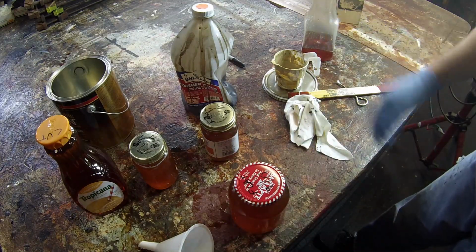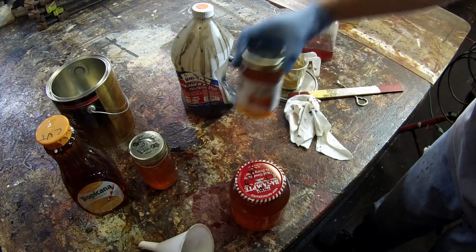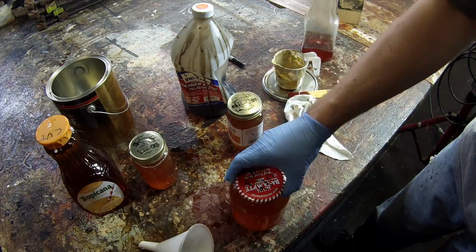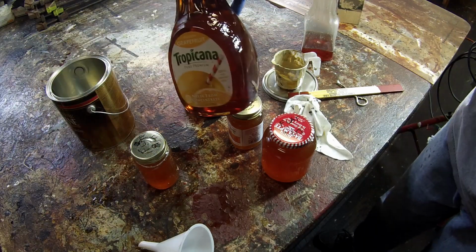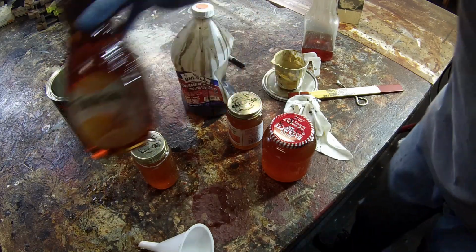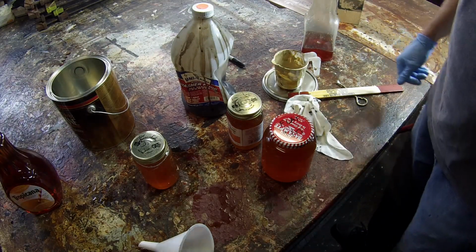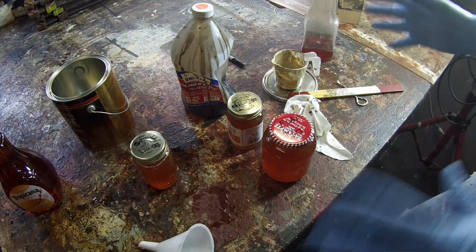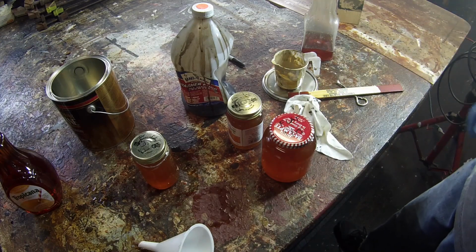All right, folks, that's how it works. 1 gallon of Minwax satin gives you a half gallon of dead flat polyurethane, plus an extra half gallon of stuff that you can mix with stain or just use for your base coats doing an oil-based finish. So it's a good process. I don't waste any product, and it turns out dead flat every time.